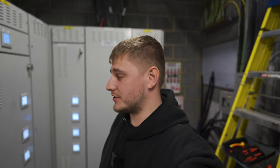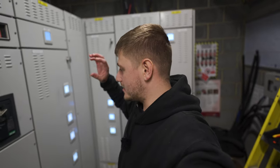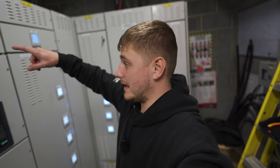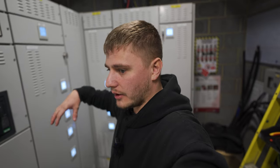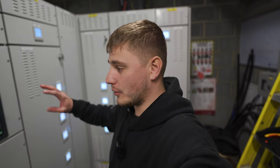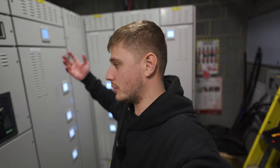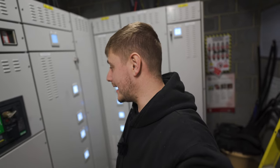They're on top of their game if you ask me - Schneider. I'm always regularly impressed with their kit, I think it's really smart and I love playing around with it. That's going to be some great initial information. I'm going to record as much data as I can from that and the Railie as well, and then hopefully we're going to come back, fit a proper data logger, and hopefully get to turn it off. I still have to be fully Arc Flash PPE'd up, but if not we will have to do it live as safely as possible, if we deem it's worth it.